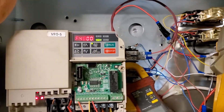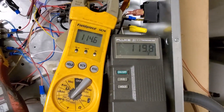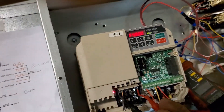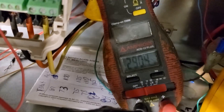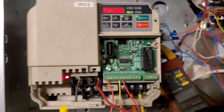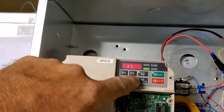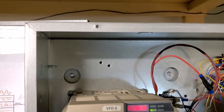It's also five o'clock so the sun is at a pretty good acute angle. Starting and running this up to 40 Hertz — this two-ton compressor with head pressure that's probably pretty high, being that it's 120-degree water. Running about 289-290 volts. I'm sure if I just dropped down a couple Hertz it would probably go right up to 300 — that would be 30 volts per panel. There's 298.